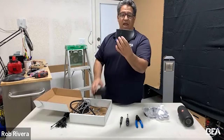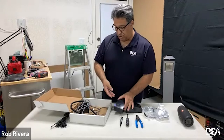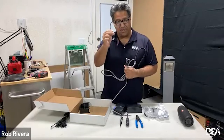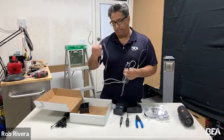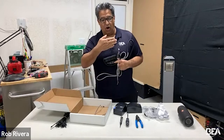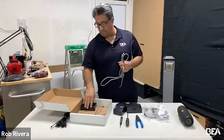These can be ordered singular for a low-energy door, but today we're talking about the full automatic safety system — one right-hand, one left-hand. These are handed because of the swoop and shape. The cover is significantly easier to get off than our micro-scan. You also get a standoff in case you have a panic bar, because the number one curtain on the push side of the door would go straight down and see the panic bar, throwing off the learn.